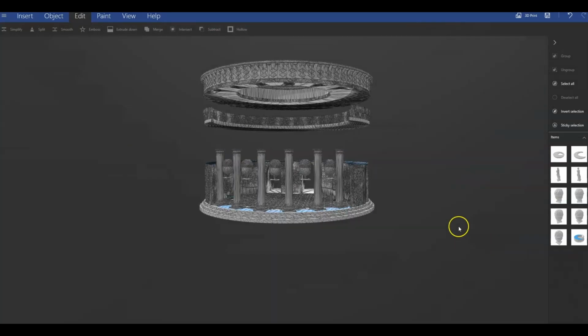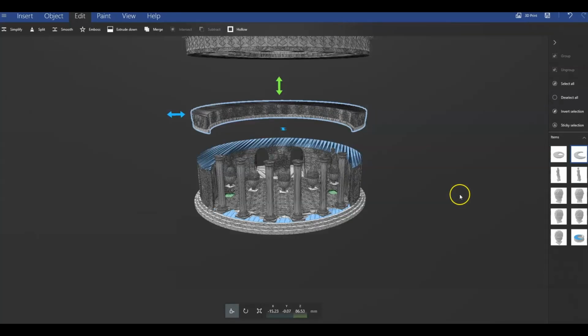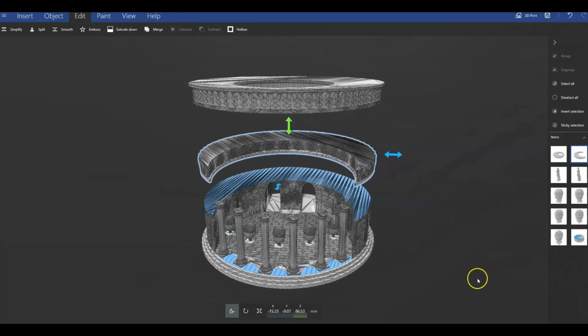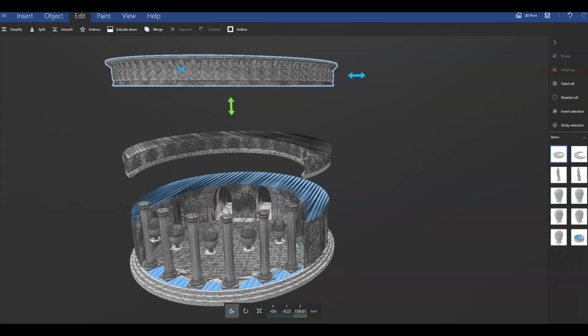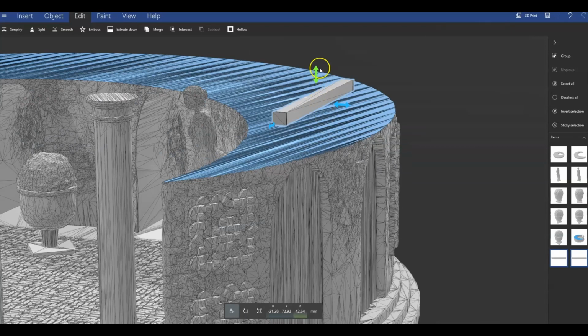So the next thing is making sure that we have some fasteners, so that to just locate the pieces. And you know, if it was a building, the building would have a roof so you can remove it. With this particular one, it might just be to locate it so you can glue it together. However, having this removable would be quite handy because it will mean that you can obviously take it off should you require it before doing other things. So we go to our assets that we have made before, and we take one of these, which is a lid peg. And we'll find these on most of our models that get split up into pieces.